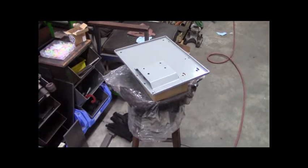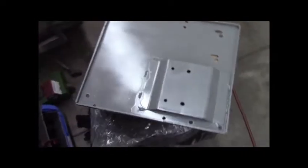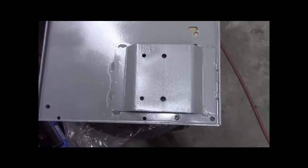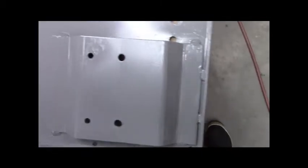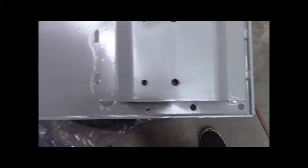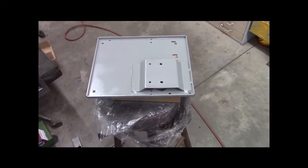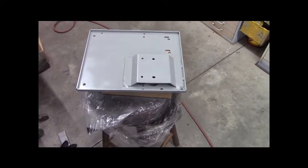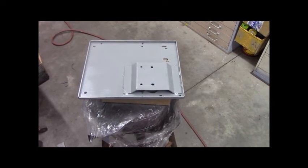The support panel is all painted up — took quite a while to clean it around those welds. The two center holes are original and the two smaller holes to the left are the ones I put in. I'm letting it dry. These welds are really good looking — I think they're stainless steel stick welds. Spending a lot of time painting and scraping. I was even taking some of the slag from the welds — they never cleaned the slag off back in 1976. I got it all detailed up. Preparation is 99% of the paint job. I'm letting it cure overnight, and tomorrow I'll fit it up.